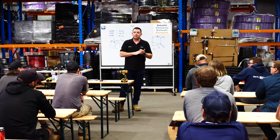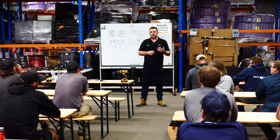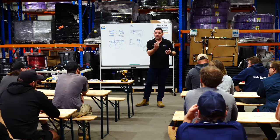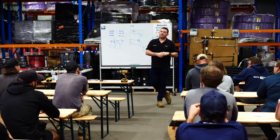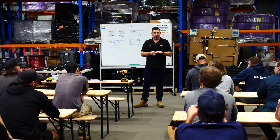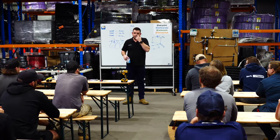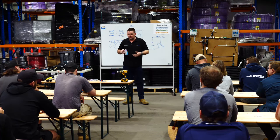Let your client know about the backflow and let them make the choice. The biggest selling point for something like that is protecting the drinking water inside their house. Most humans will care more about themselves than others, and if you say 'there's a chance you might have a chemical suck back through your tap timer going to your drinking water that your family consumes' - some people just don't care. But that's what all these protections are in place for.